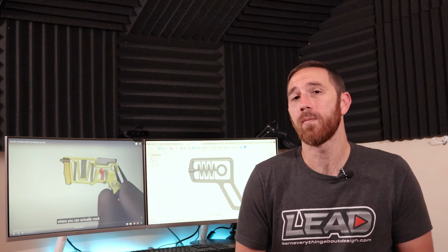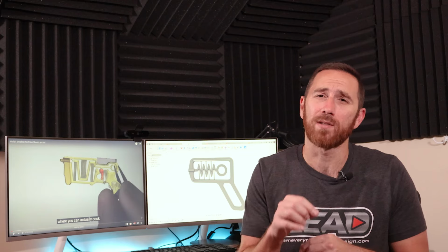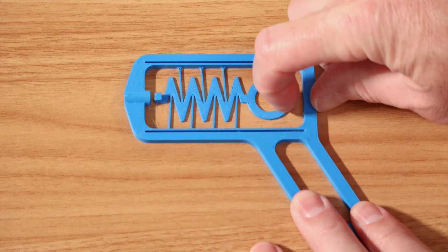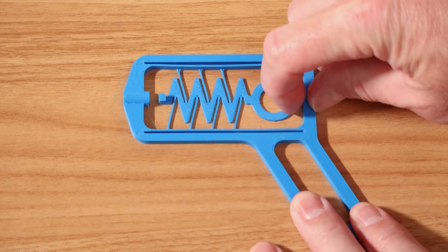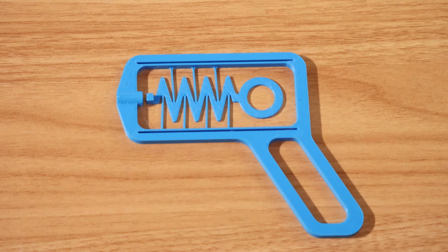Now, ultimately what I ended up finding out was that not only did the spring pieces need to be 0.8 millimeters wide, they needed to be at least 20 millimeters long. That 20 millimeters allowed them to deform in the middle to store that energy, and it resisted having too much stress on the outside edges where it connected to the rest of my part. But in addition to that, I also needed those outside sections to flex inwards. That was a key part of this, and allowing it to perform to store the energy and not get into that plastic deformation range.